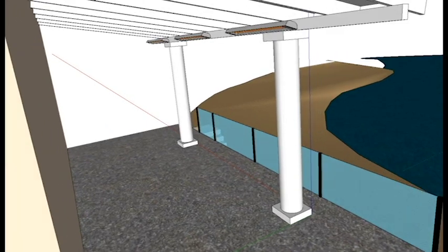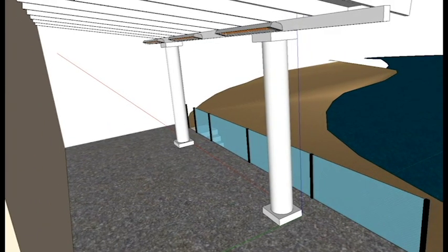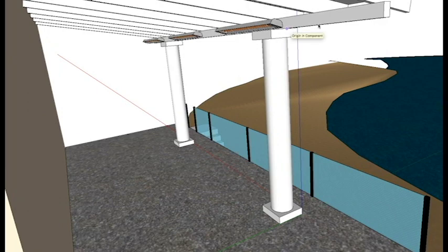I know my client has experience with this on another property, and they're really concerned with the corrosion that they've experienced on the other property. But it would be my recommendation to still consider the Infratech much more heavily because of that wind issue, number one, and the corrosive issue is still going to be there with a gas heater. In fact, there are more components inside the gas heater than there are in the electric heater that you would have to service. So keep that in mind when you make your decision.